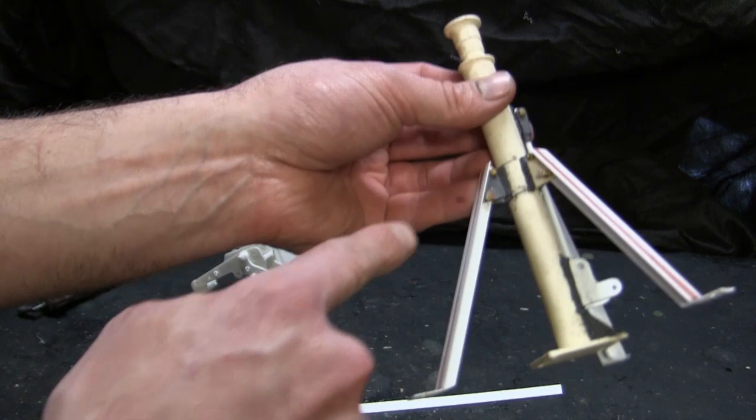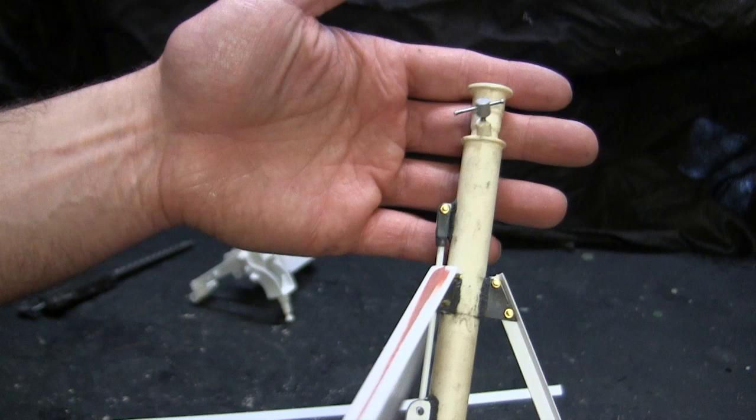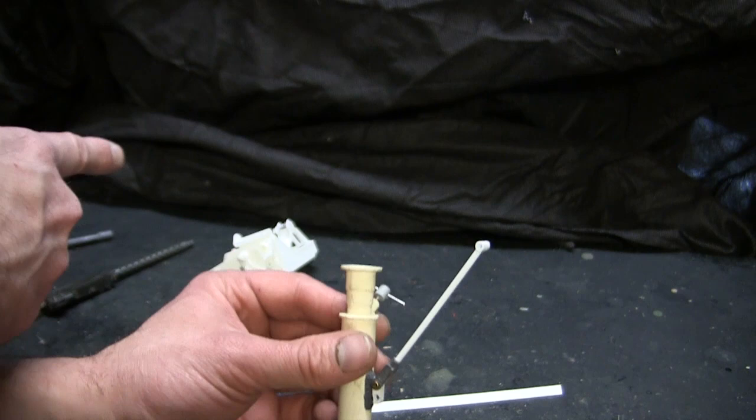The pieces are fastened in place with small brass micro fasteners. I believe these are 2-56, and then sculpted weld beads were added just to complete the look. So that's really all there is to this. Of course, this is the travel lock, and this can pivot upward and lock into the recess found on the rear portion of the cradle that I'll touch upon later.